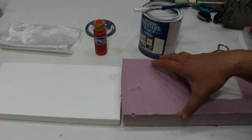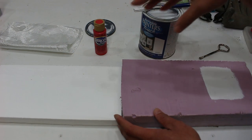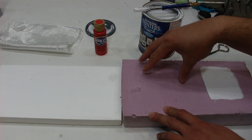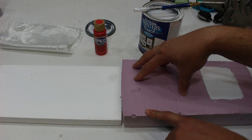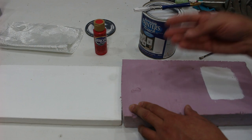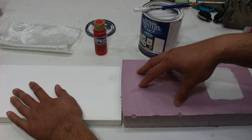But to give you the shorthand version, when I talk about this type of foam in one of the videos for that series, this foam here, stuff doesn't like to stick to it very well. Because for whatever reason, whatever blowing agent they use to make this, stuff doesn't like to adhere to it as well as this stuff over here, as well as the styrofoam, polystyrene.